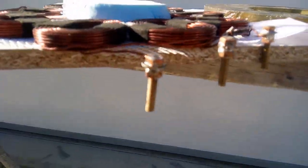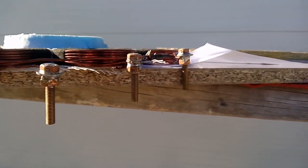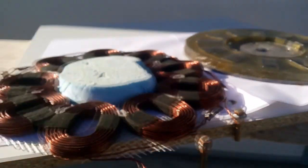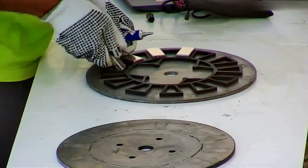Unfortunately I had some trouble because the magnets I got are smaller than advertised by the seller, and I only noticed that when making the coils. And since I already had the magnet rotors made, I had to chisel everything loose and glue them again in the correct position, or else I would end up with a very inefficient generator.